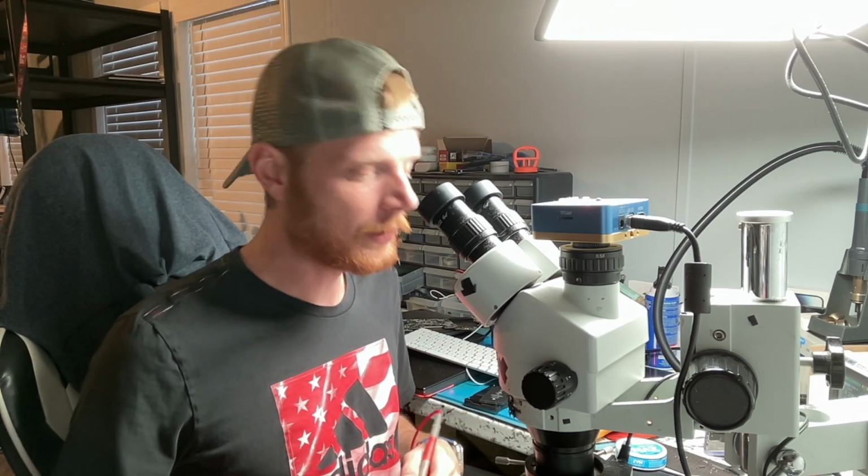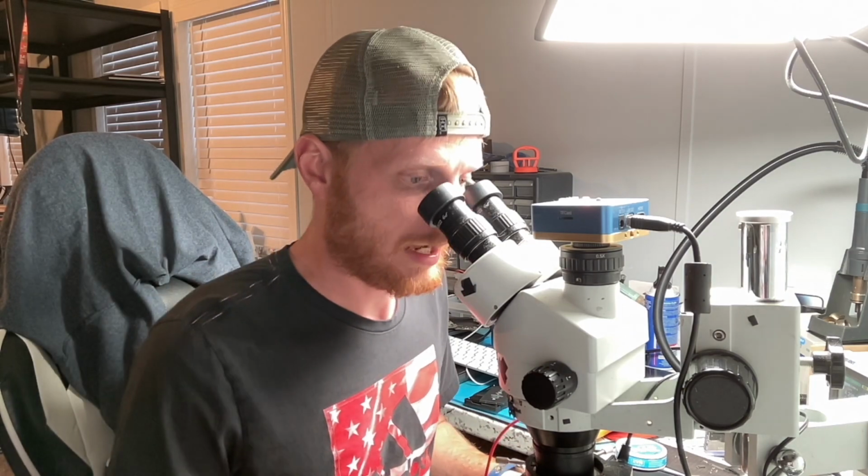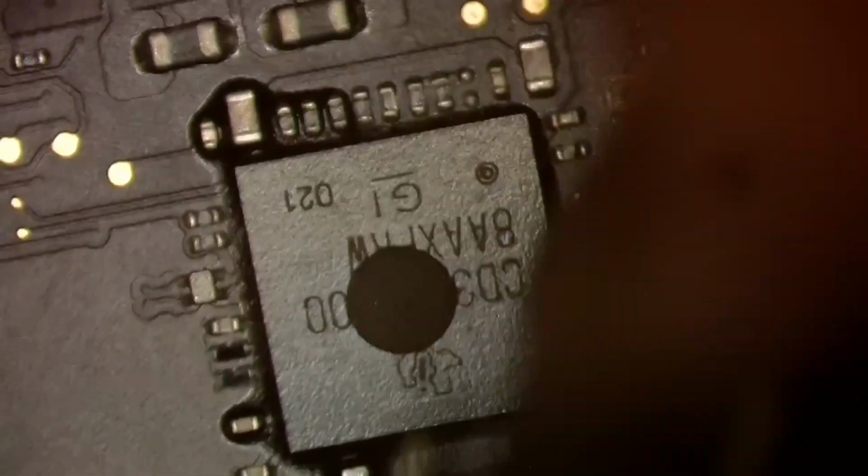That's normal if you have a lower resistance line, like it's normally supposed to be like 150, 200-ish in that area. When you plug power into it and then unplug it and immediately test, you can get something like 0.078 or a much lower reading. So it's not always reliable in that sense. But let's go ahead and continue diode moding around that CD3215.